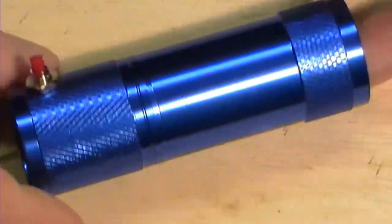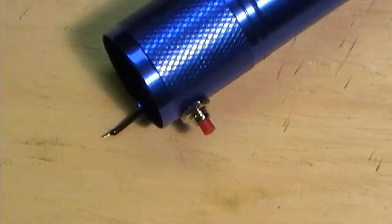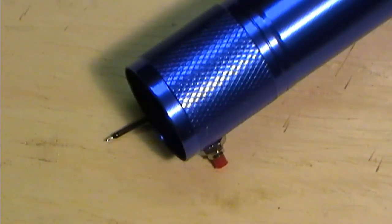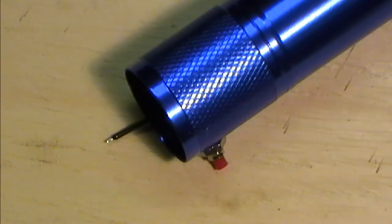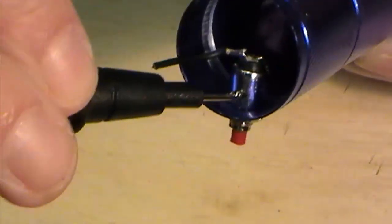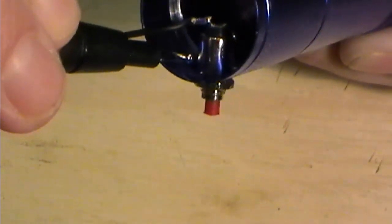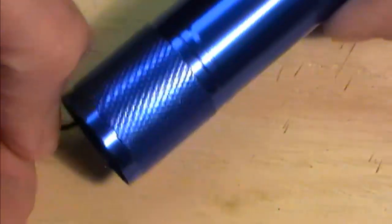And I'll show you what I mean about the way that's earthed, and how the switch will work. And just turn on the Fluke, get a bit of beepage going. So I've got me beeps. Now if I hold one on the inner screw thread here and come up to my wire here, I've got nothing at all. However, on the body of my case, or my switch case there, if I touch that, I've got continuity. Now if I hold that on the other end of the wire and press down on the switch, bear with me 1 second, which is difficult,